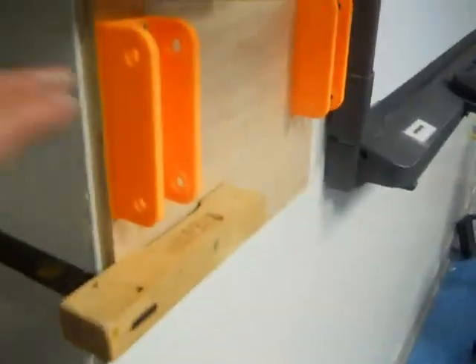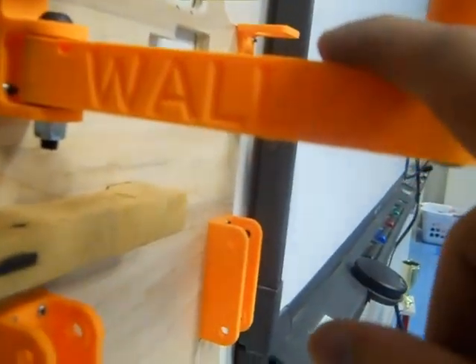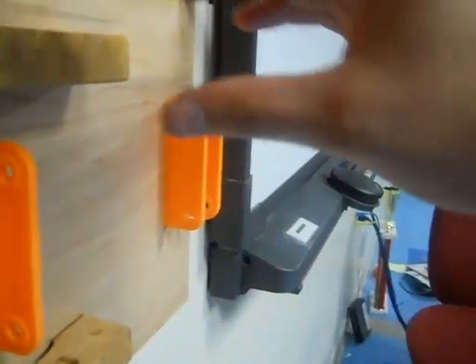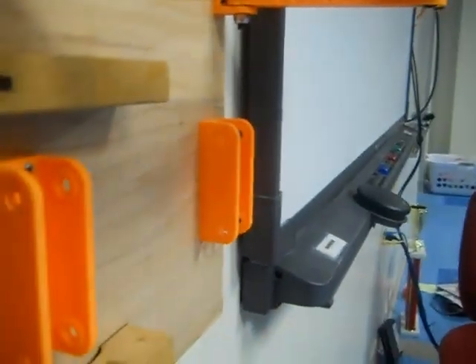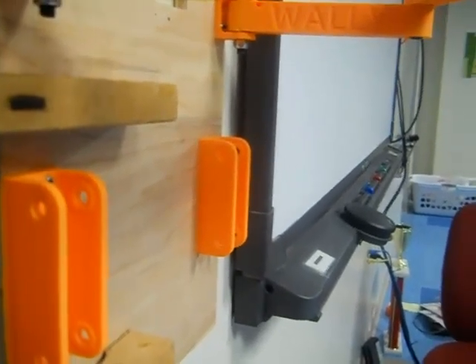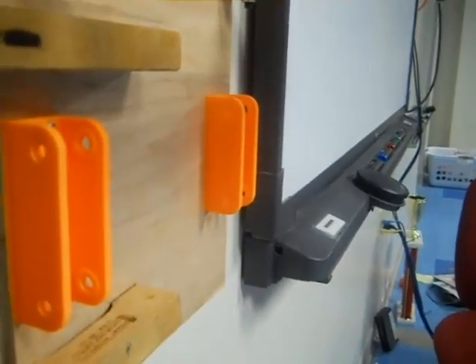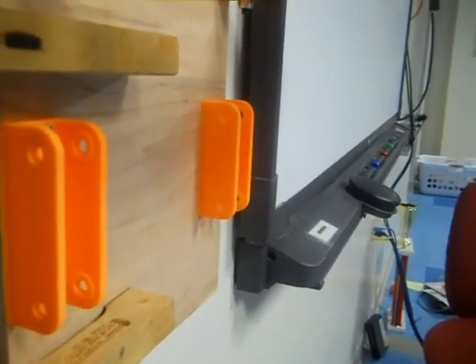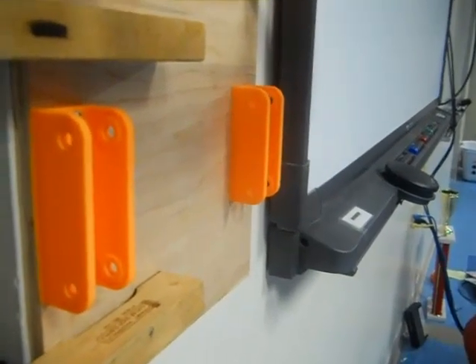Down here on the Z, I don't have any arms yet, but they're the same arms as these with the Hall effect sensor embedded in them. The bracket for the Z-bed — I will put a magnet in that, so it'll be the exact same deal. I'll be able to do the splitting so I can get the straight-out 90-degree configuration, or calibrate it in firmware. I'm really crossing my fingers on the splitting-the-difference technique, but that is yet to be proven.